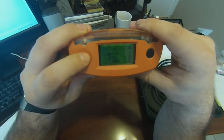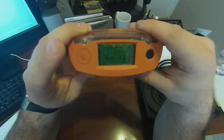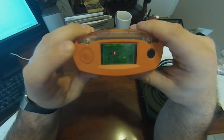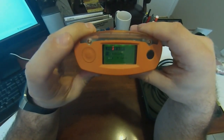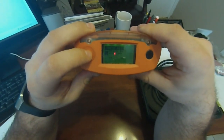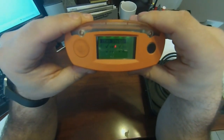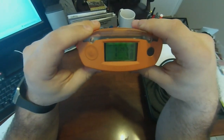TWA is time-weighted average — and I just skipped past it, we'll go back to it. Of course it's not set up for any of those. And then if we need to zero out at any time, you have your ability to zero here. 'Fresh air?' — it's asking you if you are in fresh air, click to confirm. And we've zeroed it out again, which was fine to begin with.